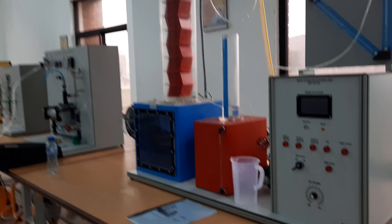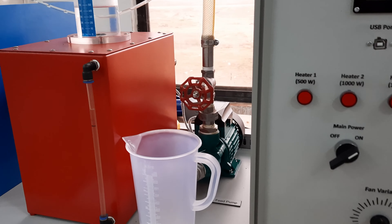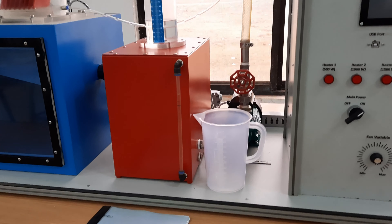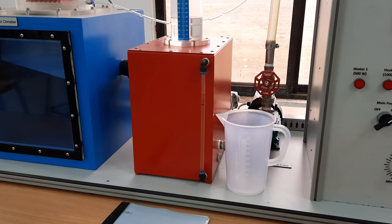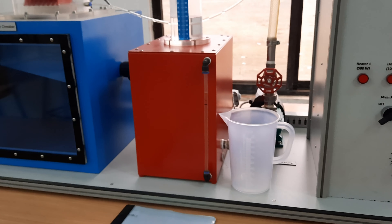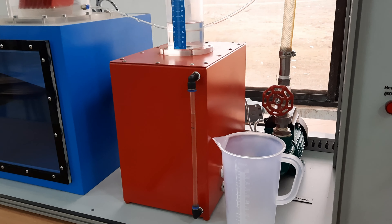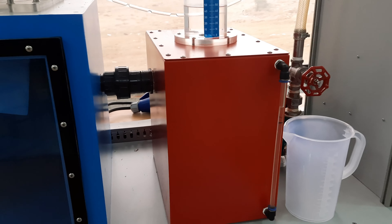The cycle starts from this red tank, which serves as a water reservoir. This heated water reservoir has a 1.5 kilowatt immersion type heater installed in the tank which heats up the water. The temperature of this tank is displayed on the LCD display. This heated tank also has an electronic level switch which protects both the pump and the heater from dry run.